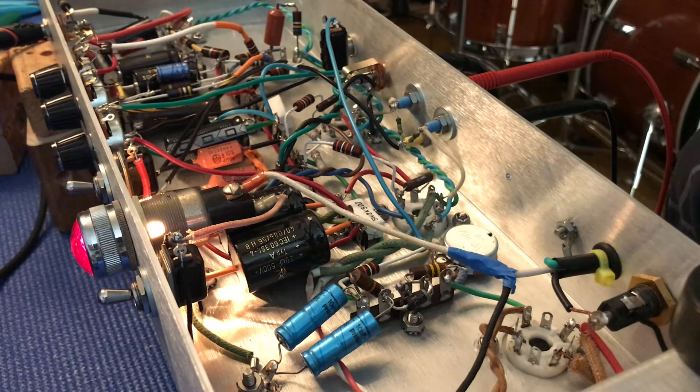A quick rundown of this amp: it's got a parallel-strapped octal preamp tube, a 6SL7 here, and the signal comes down to the first triode of the other 6SL7, another octal preamp tube. The second triode is utilized as a cathode phase inverter feeding the output section.